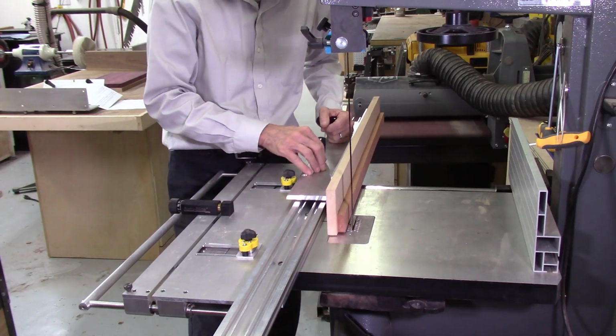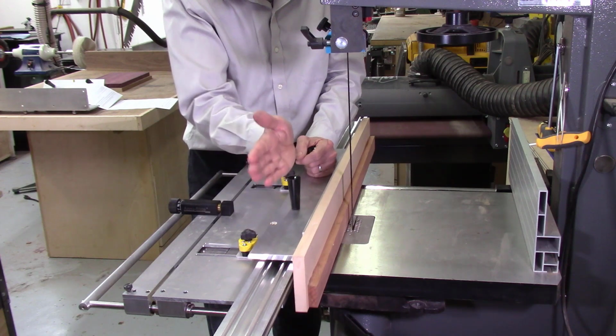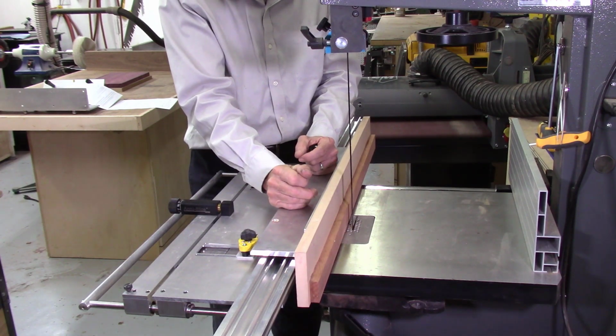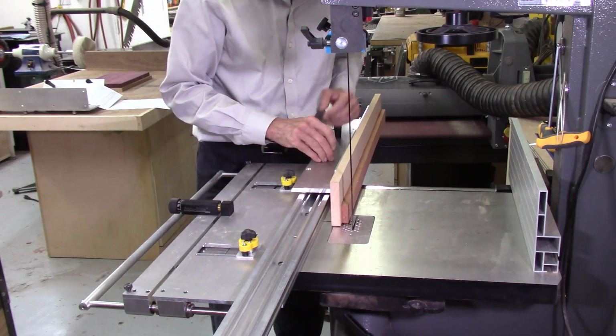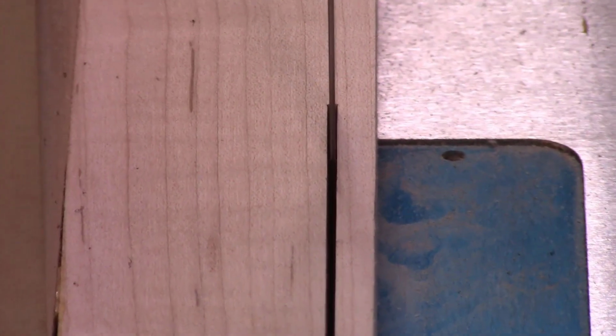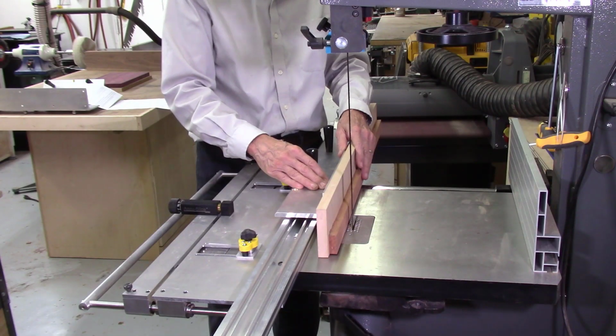It's the same concept. Because this board is moving perfectly straight and parallel, there's no lateral movement of that wood whatsoever, and as a result you get no blade drift issues. And the way this works is you have your blade, again, creating a kerf. That kerf is wider than the back edge of the blade. The board's going perfectly straight through the wood. The back edge of the blade never touches that kerf side of the wood as you're cutting, and as a result you get no blade drift issues. You get perfectly straight, flat boards that are perfectly straight with parallel sides.